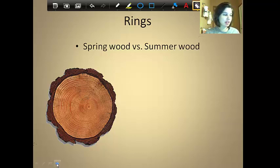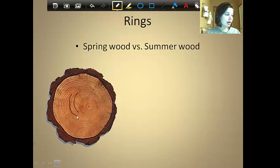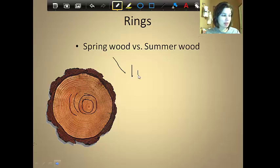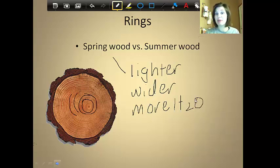If you look at this picture of this tree cross section, you'll see there are darker rings and also lighter rings. The lighter ones are the spring wood. The spring wood is lighter in color and also wider — a wider, thicker ring than the summer wood. The reason it's lighter in color and wider is because there's typically more rain in the spring. So when the tree is growing this layer of wood, it's got lots of water — more H₂O. Lots of water means the cells get bigger because the cells store the water. If there's lots of water, those cells have to be big to store it.